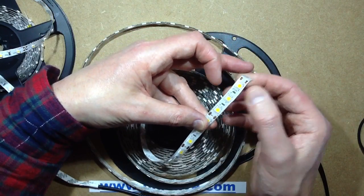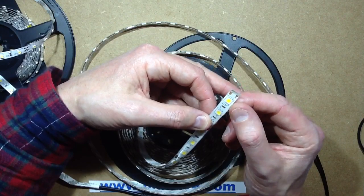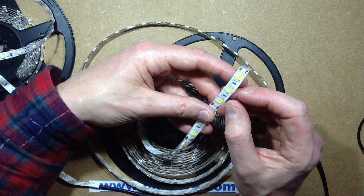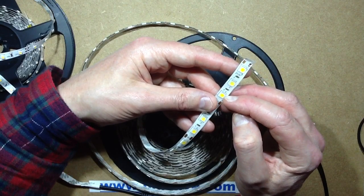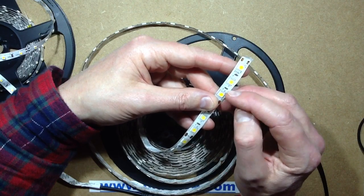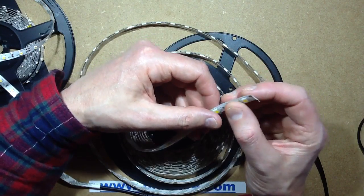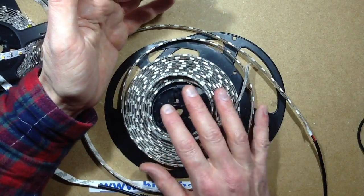The reason for the two resistors is to keep the dissipation down, I'm guessing. The resistors are actually 47 ohm resistors. In an ideal world, if all the LEDs were just dropping 3 volts each, that would be 9 volts total across the LEDs. From 12 volts, that's 3 volts to drop across two 47 ohm resistors — roughly 100 ohms — which would give about 30 milliamps per section. With 100 sections along this, you'd expect about 3 amps.